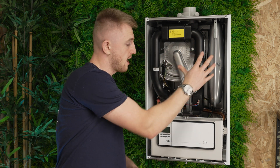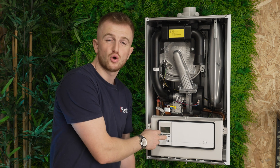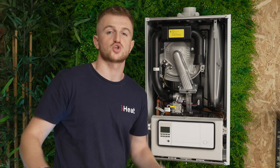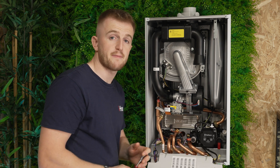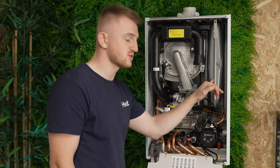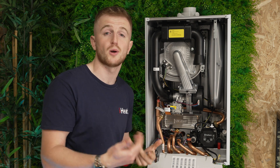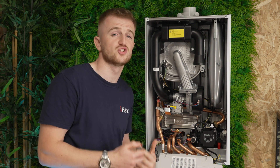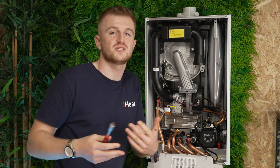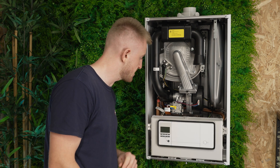There she is. Before we delve into the different parts, the control is an easy text display — nice and easy to understand, with plus and minus buttons, a left menu button and a right menu button. Very simple, easy enough to explain to anyone. Popping the flap down you get exposed to the pump, the plate heat exchanger, the fan, the heat exchanger at the top, and the expansion vessel over on the right before the flue up top. If you're looking for a rear flue option, go for the EcoFit Pure as that has that really cool feature. There's also a mini analog pressure gauge on the far right, very easy and useful for an engineer when servicing. Pop up the flap, get the case back on and you're good to go.